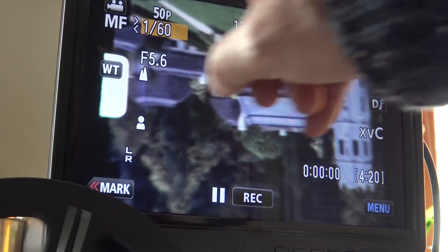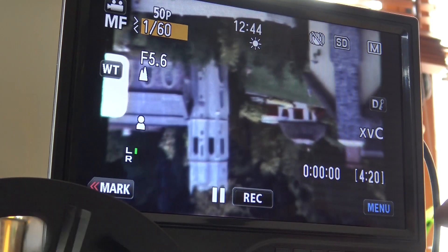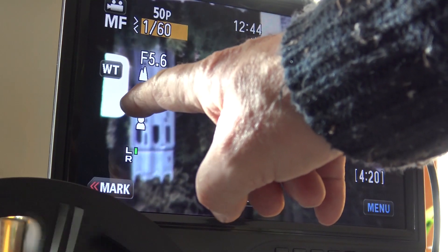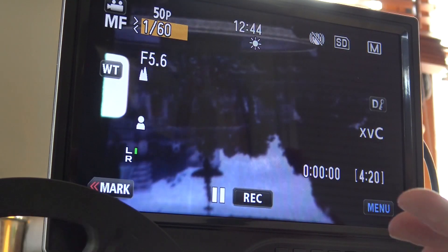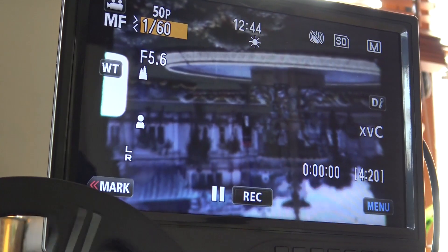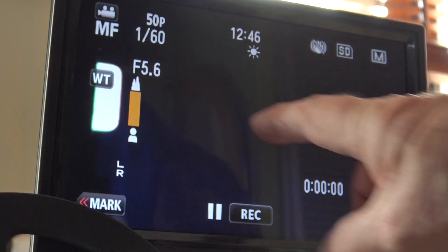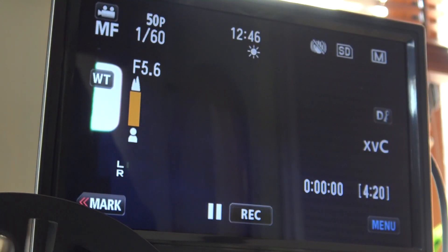You can see you've got the whole frame now as it's cropped normally on a standard projector, and the sprocket hole here is also in view. It's also upside down, and you can invert this and crop it anywhere you want in the edit. The iris is set at 5.6, so I adjust the exposure on the LED lamp dimmer.